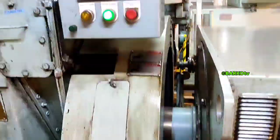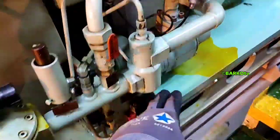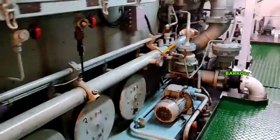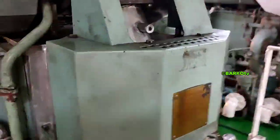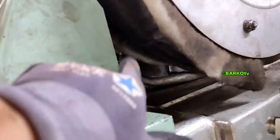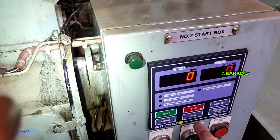All parameters are normal and there are no abnormal alarms coming up. We check the pressure — seven bars. This is the jet assist solenoid; that is related to the jet assist, which is connected to the turbocharger. That pipe below is intended for jet assist.